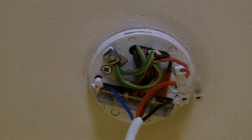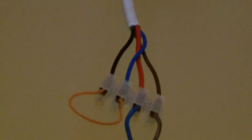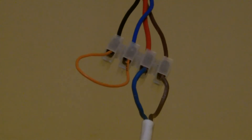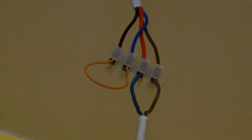The reason it's been wired strangely is because this is normally configured for switched live, so the live is switched and the bulb is permanently connected to the neutral side. That's the normal configuration you'd expect in the UK. What I've done is changed that setup because I wanted to have a switched neutral, and sometimes you get this strange effect.